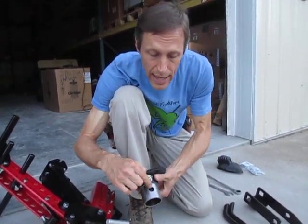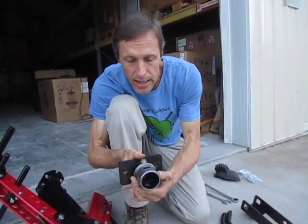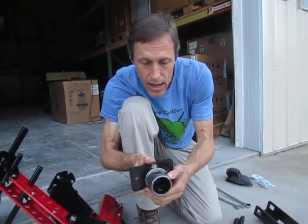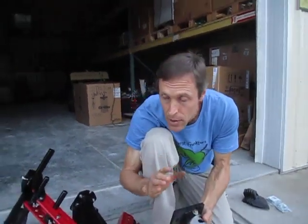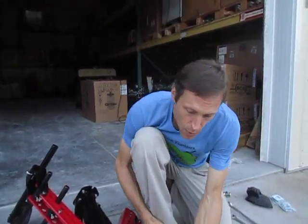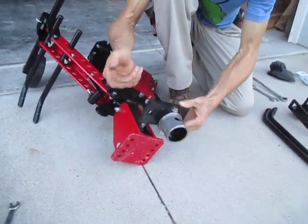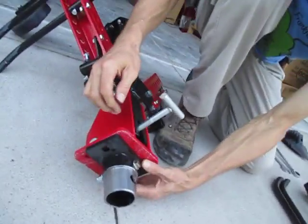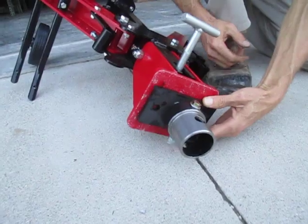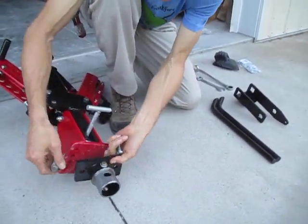You don't need a lot of pivot — you don't want the thing flopping around on turns. These swivel hitches are manufactured with a locking hole for the quick coupling on one side and a slot on the other. The slot allows a little bit of movement. Typically you want this because if a tractor wheel drops in a hole, you don't want the whole cultivator to tilt — you want the gauge wheels to hold it level. Orient this with the slot at the top. There are different holes depending on your tractor wheel height, and it comes with nuts and bolts to attach it in the appropriate holes.